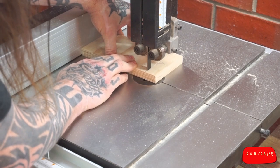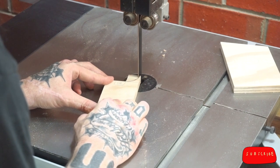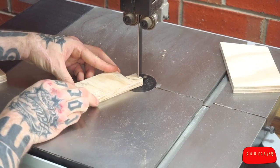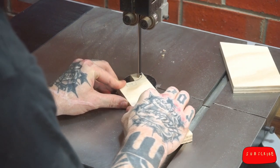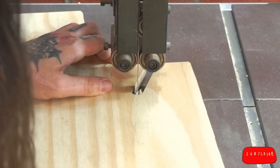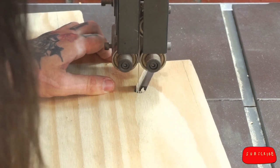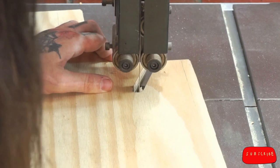We've got some curves to saw out, so I rough them out on the bandsaw. I'm not too worried about perfection right now, just getting reasonably close to the lines. This blade isn't so good for tight curves — I use it primarily for cutting scarf joints. Sometimes when you're on the bandsaw, you'll run into curves you just can't get to. A thing I do is cut little fingers out of the work piece and use the blade to sand away any nubs that are left. You can clean it up with a file after that if you need to.